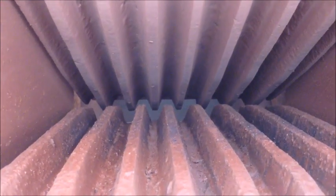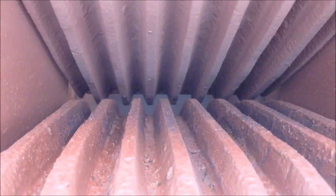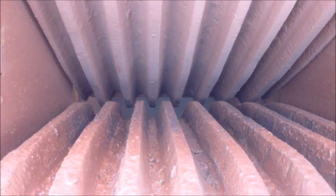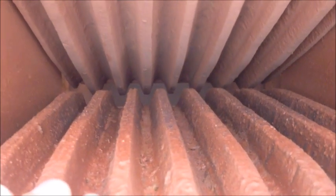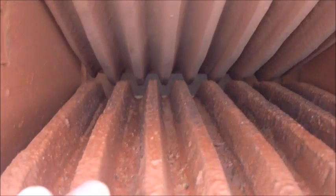After any adjustment is made to the jaws — either replacing them or tightening or loosening them — it's important to take off one of the guards and rotate the jaw over by hand a few times to make sure that these teeth mesh and don't hit or bind. If the jaw crusher is started and the teeth don't mesh, you may damage the crusher or the jaw plates.